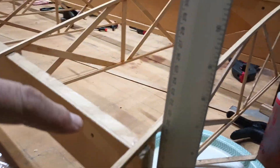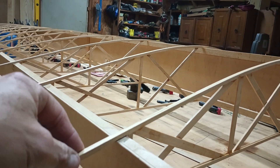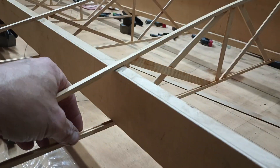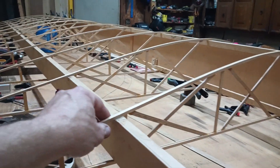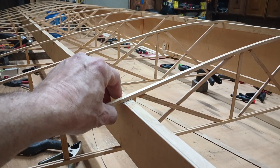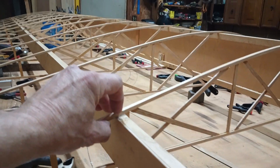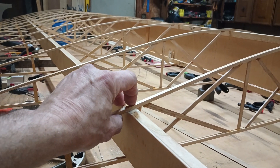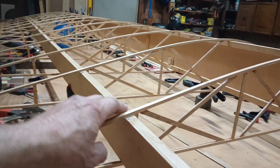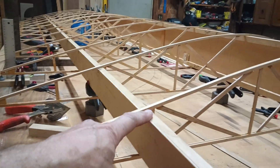What I have to do now is take my oscillating saw — I use it like a scalpel — and cut all these beautiful tight joints, every one of them. Now I'll have to use shims. I needed a few shims anyway, but now I'll have to put thicker shims in. There might be a couple of ribs where I'll want to scab some material on the side of them.